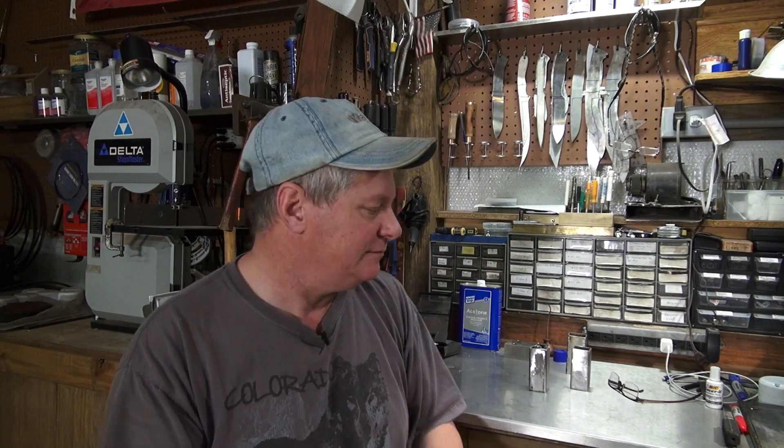It's just a cross. I'm going to put it in a can, fill it up with powder, and weld my caps on. Another thing I did is I took a torch and brought the can up to cherry red all over and made it scale inside. The reason I'm doing that is because I heard Steve Schwarzer mention using burnt stainless. This is a 316L stainless can, and I just charred it.